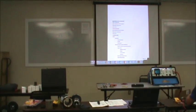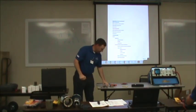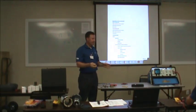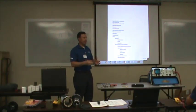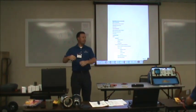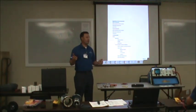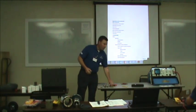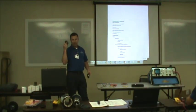Lubrication on these, I guess we can cover that a little bit on mechanical. If you're already using a grease, you don't want to change in mid-stride. When you do a change, the lubricant manufacturers will tell you you've got to get all the old grease out before you put new in. When we repair a motor, all bearings that we sell that go in a motor come pre-lubed with polyurea-based grease.